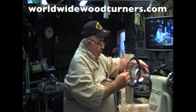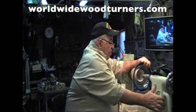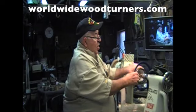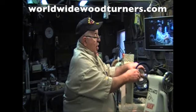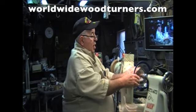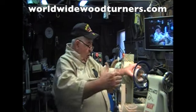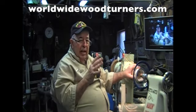Now, I want to turn it this way with the open side out, bring up my rest and balance it out until it's running true. And there's a secret to it. Time. It takes a few moments to pull it and get it around, and you'll get it running true. Now I can clean up this outside. I can go around to the inside, to almost the center. Almost. But remember, I'm cleaning it up.